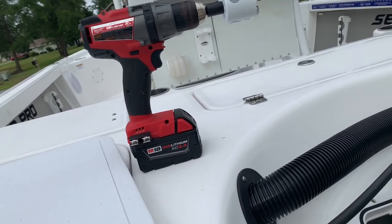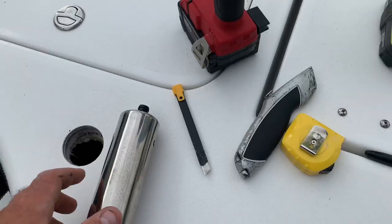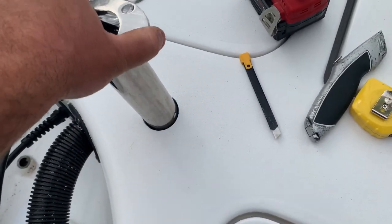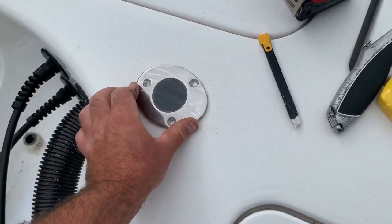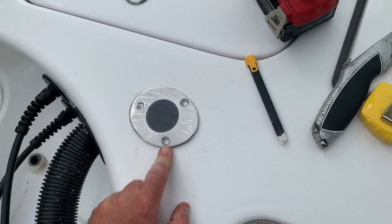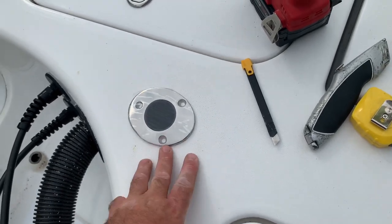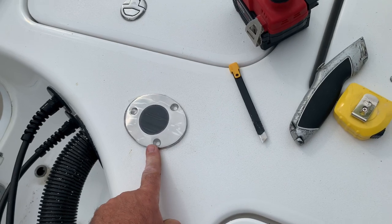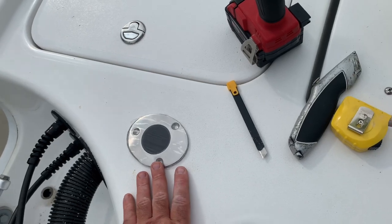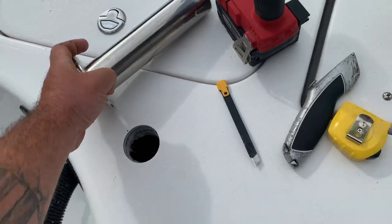Let's get started. Cut my hole — had to get through a little bit of insulation and the floaty foam stuff on the inside. Here's my rod holder, and she slips right in. Next I'll drill the pilot holes and countersink them just a little bit. The reason you want to countersink is to avoid the gel coat from cracking — if you put it in with just a pilot hole, you tend to crack the gel coat.